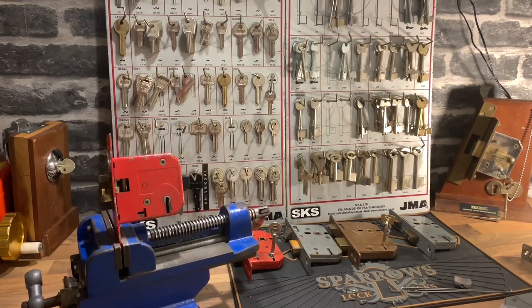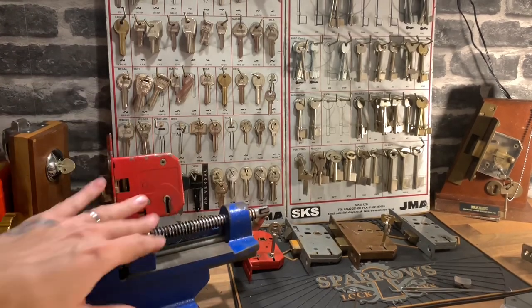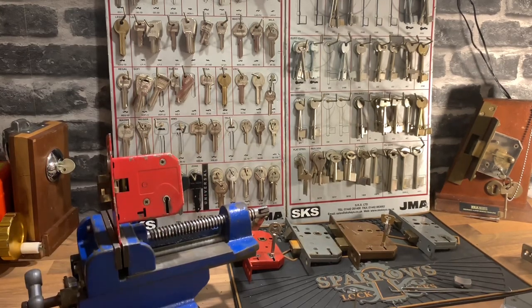Why is this my number 10? Because they're very easy to open. Yes, it's a five-lever lock, yes it's got a curtain in it, and obviously it's not British Standard, but it doesn't have any anti-pick notches and it doesn't have any false gates on this lock — just the same as the old Legge. So there's no anti-pick notches, no false gates — you really can't go wrong with it.